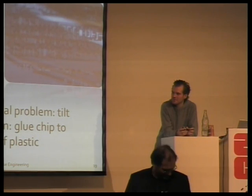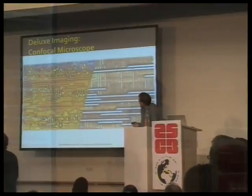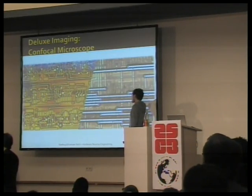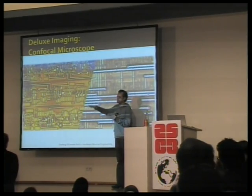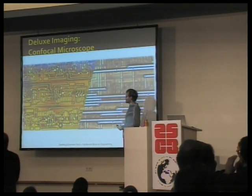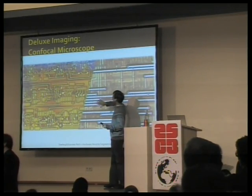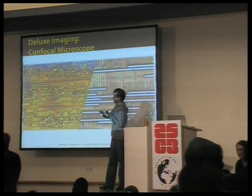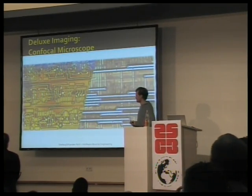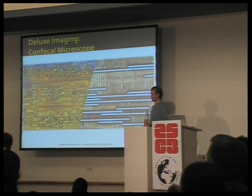Have you ever tried to reverse any non-planar technology, like MEMS? Yes, and in fact, this is a non-planar chip. Can't really tell in these images. They happen to be fairly nice, but planarizing a chip means that after you put a layer down, you basically file it so it's straight again, and then you put the next layer down and you file it again. Before they started doing that, the chips became a little wobbly on top of the lines. And if we file these down, we see that wherever there's a line below, we have to file harder, or something is left if we file with the same strength everywhere. So non-planarized chips are harder to work with, but they're also easier because they're older and everything is bigger and easier to take pictures of. But yeah, we can break both.